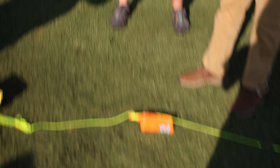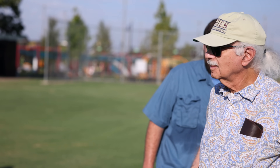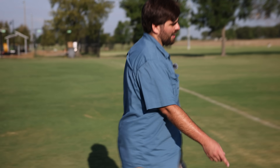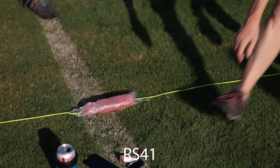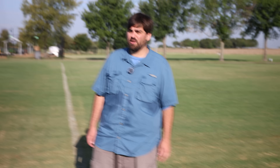This next payload, the orange box, is another RS-41 — the radiosonde that the weather service launches. This one also has a Geiger counter on it, so we're monitoring pulse counts to see how it does through the flight. And the next payload, through this long dipole here, is yet another RS-41 tracker, but it has a 20-meter dipole — it's going to be transmitting on 14.070, the PSK channel, but using the Horus binary mode. Anyway, these are our payloads and I think we're about ready for launch.